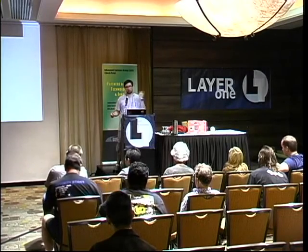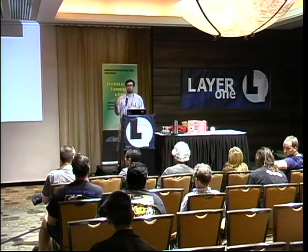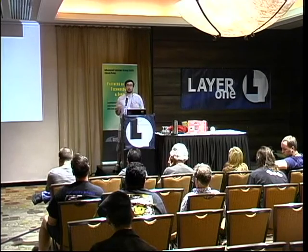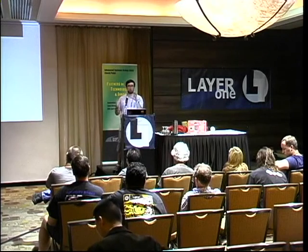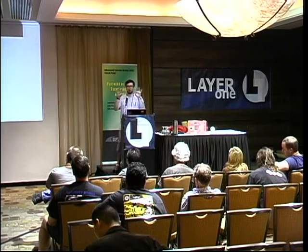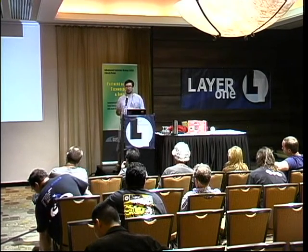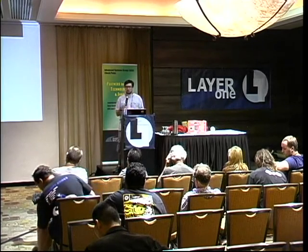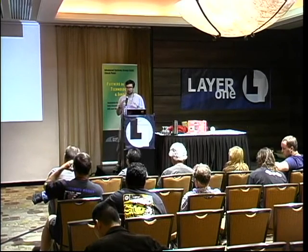So essentially, you purge all that dry nitrogen out, it's cold, and now it's in a vacuum, and now you can do a proper test. If a component's overheating, it's overcoming that cold temperature and not dissipating the heat, and you could find out. There are different tests you could do. A really good idea is to have an IR camera and a little window aimed at it, so you can look at how the board heats up in different places. You really don't need to do it on a really basic board. As long as you lump them together with the materials I mentioned, the heat's going to stay pretty constant, and you're going to be okay.